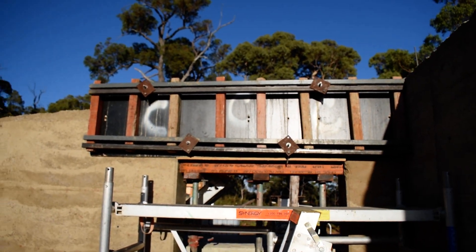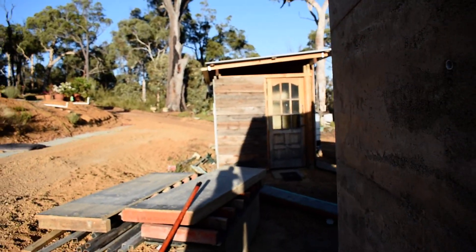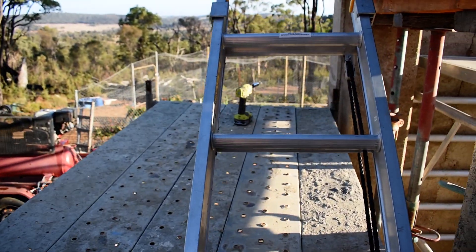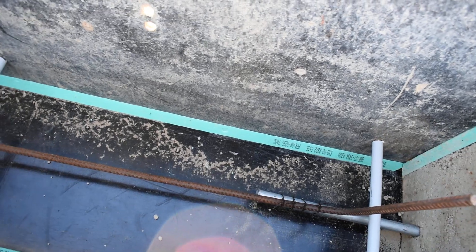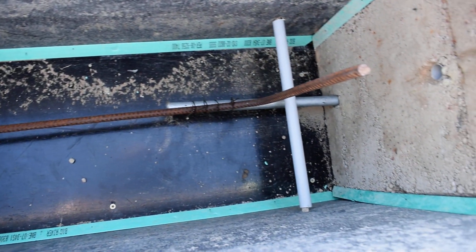I'm just going to give you a run through what goes on up in the box on the overhangs. The reinforced lintel they call it, instead of putting in one of them big steel lintels that they do with the bricks. I'll just give you a rundown — pull up the ladder here a bit. Got them rods sticking out of the wall where I put the conduits. I'll ram that and then put a second rod in there and tie a bit of steel to it.